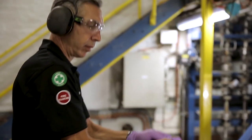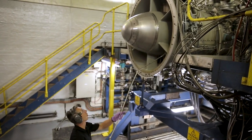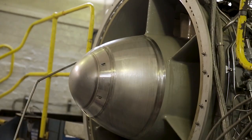Inhibiting fluid is being sprayed manually to the air inlet to coat the gas wash surfaces. Please allow this to drain and then refit the drain blanks. The gas turbine has now been inhibited and is ready to be removed.